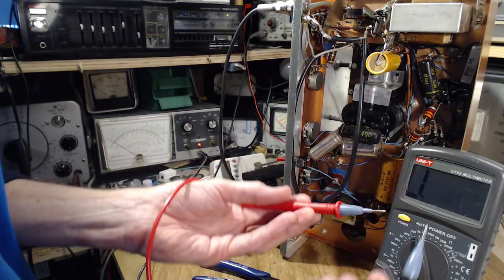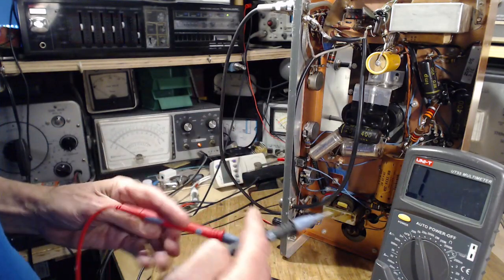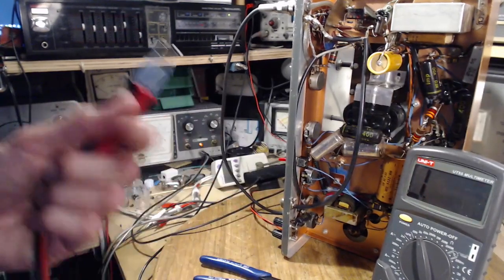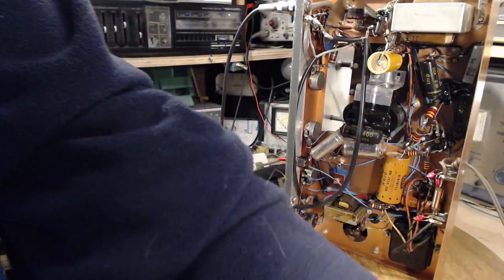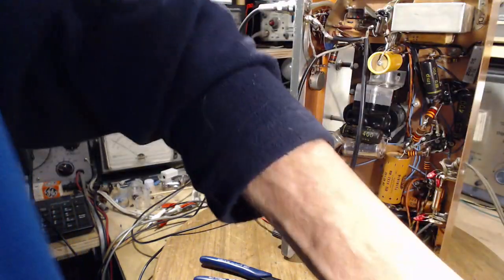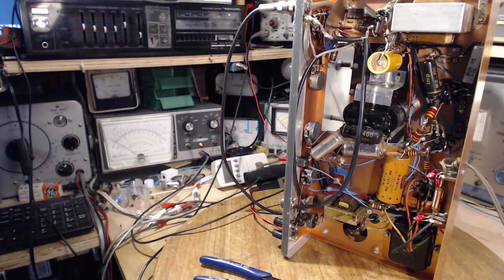So this is putting out some voltage on these leads. You would think it'd be enough to overcome the forward drop on that diode. Rectifier, I should call it a rectifier. Maybe that, so I don't know, did I just prove it's totally defective? Let's stick a silicon diode in there and go from there.